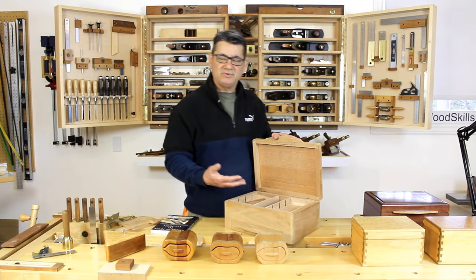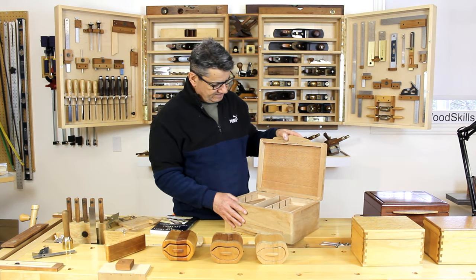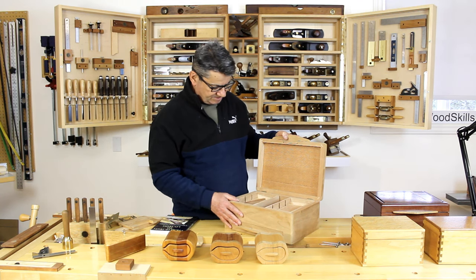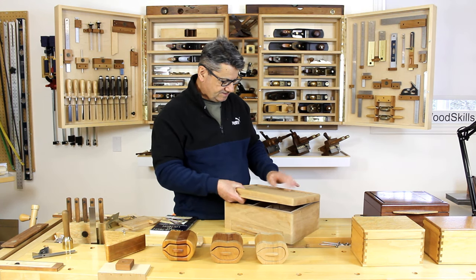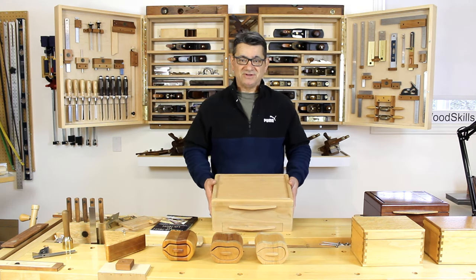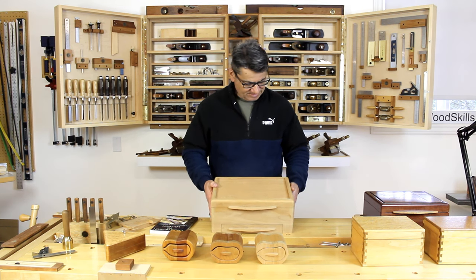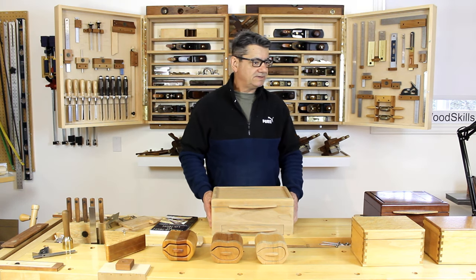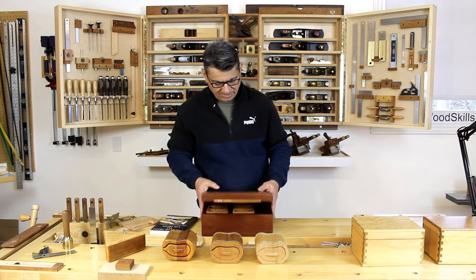The interesting part is the hinges - back-mounted stop hinges, probably the first time I used them. I developed specialized templates to mount them because the boxes are created as one unit and then sawn open, cleaned up, and attached with hinges. Introducing back-mounted hinges means you don't see the hinge, it's cleaner, and it's installed on the back without any visible hinge within the jewelry box itself. I also created humidors at the time - essentially the same box with a different interior, and that was a good market too.